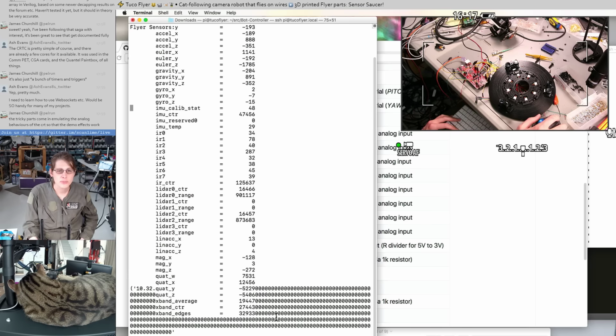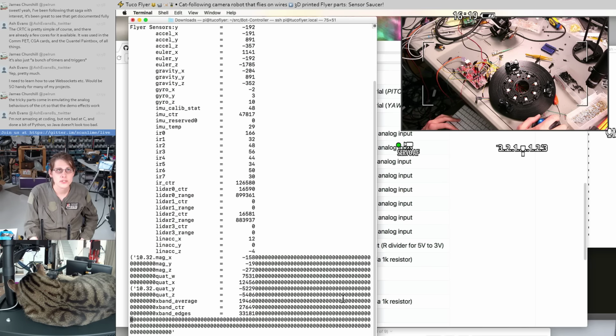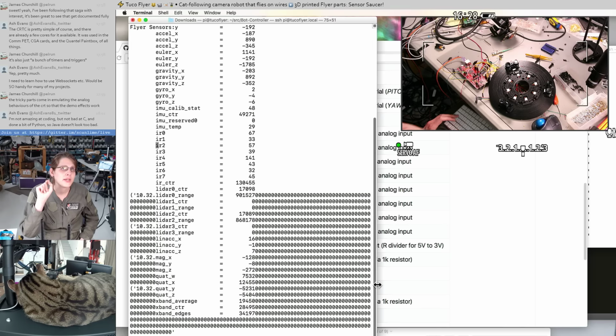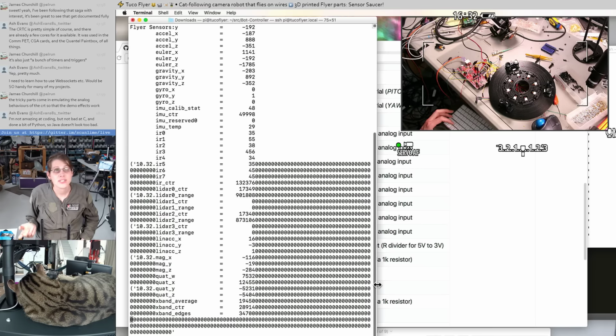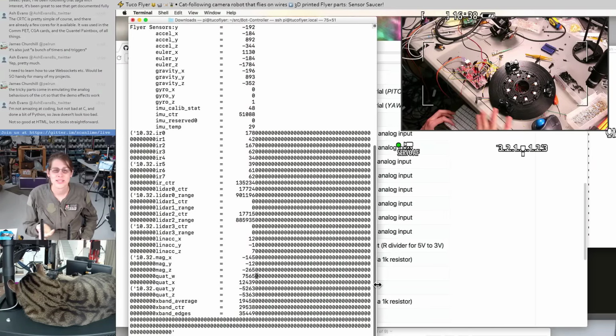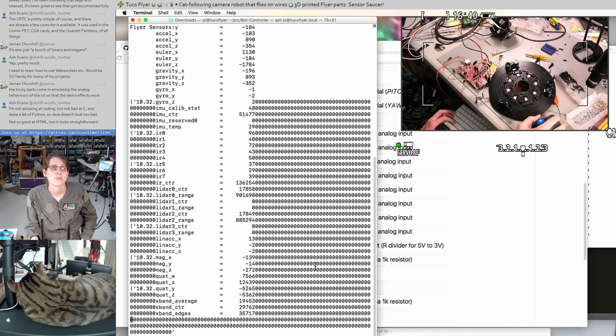All these spurious things we're getting down here, the ones that are all zeros, that's actually just noise coming in on the serial port that would normally plug into the gimbal. If there's just a momentary pulse on that port, then the UART could see that as a start bit. And then if it sees that, and then all zeros, and then a 0 stop bit, then what do you know? It's a 0 byte. So that's why we get these packets full of zeros every so often.